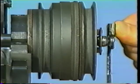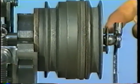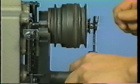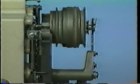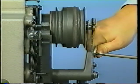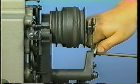If clearance A is small and clearance B is large, torque is inefficient for low-speed mode, or the high-speed pulley will get heated because of contact between the changeover pulley and the high-speed pulley. So, it is necessary to adjust clearances A and B equally with accuracy.